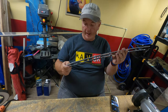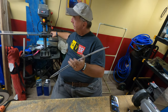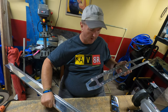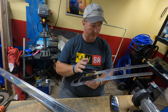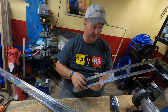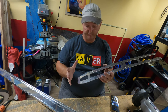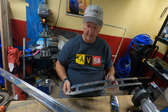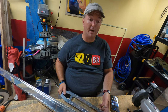I've gone ahead and removed everything, except the spar caps are still in there in the spar. I have de-burred this, and with the last little bit of countersinking, this is ready to be scuffed up, pre-coated, and primed. We are ready for prime time, baby.